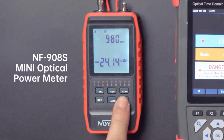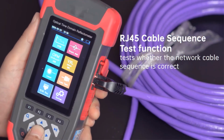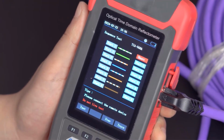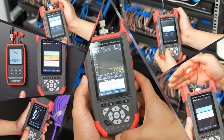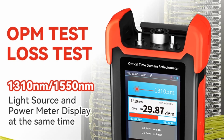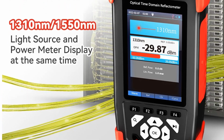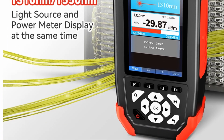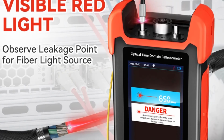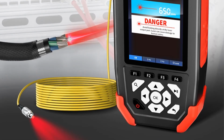The NF-981S variant operates at a single wavelength of 1550 nanometers, allowing testing without interrupting the signal light in the line. Key features include event mapping for graphical representation of test results, optical power testing, and fault location using visible red light injection. This reflectometer is suitable for testing telecommunications, CATV, and LAN optical cable parameters, making it a versatile and efficient tool for optical fiber testing and maintenance.